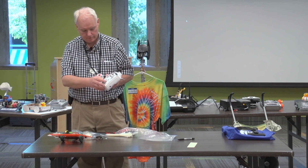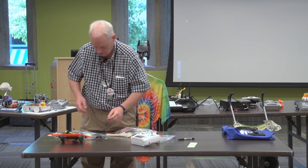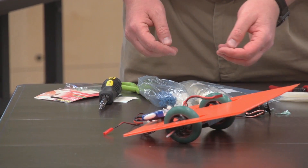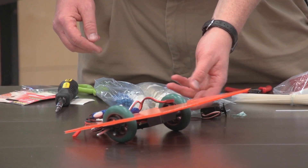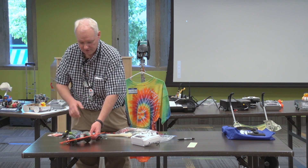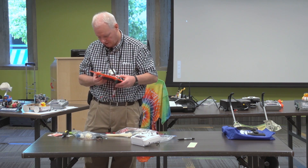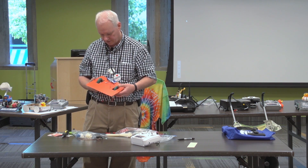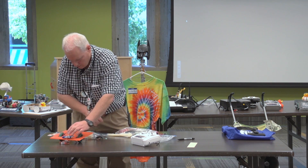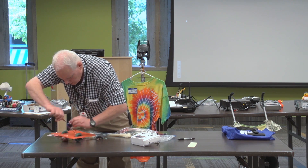I need a transmitter, so I'm going to turn on this cheapo transmitter — which is awesome. The center of gravity is too far in the back; it's popping a wheelie and the front end is going up. That would not be very good for getting the wedge underneath another robot, so I'm going to have to move something heavy, like the battery, forward. That'll be easy to do.